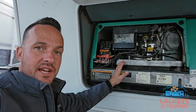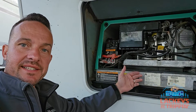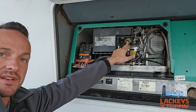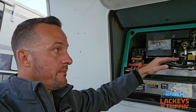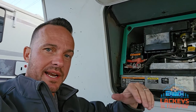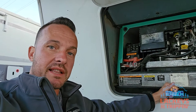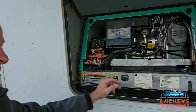I had some time to diagnose this generator a little bit more. I figured out that I could get it running with some little tweaks. I adjusted the altitude knob — it was actually at the wrong setting. I got it running a little bit better and smoother, but the idle was still kind of fluctuating. That told me the generator was having trouble regulating its speed.